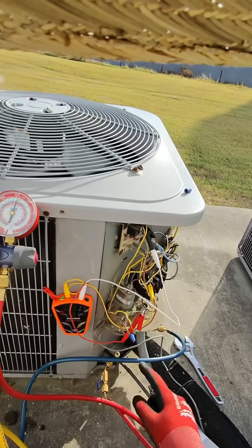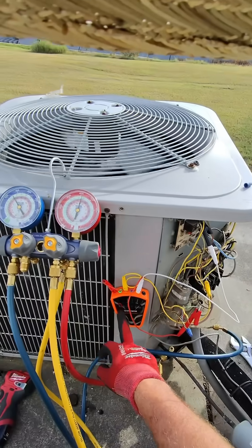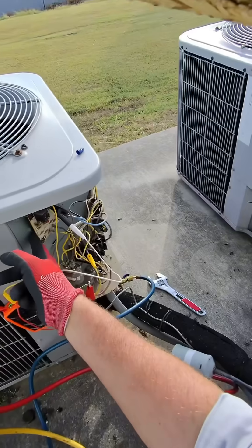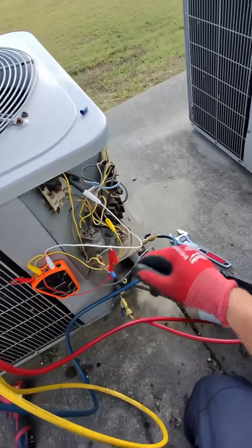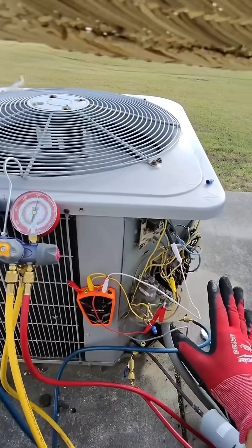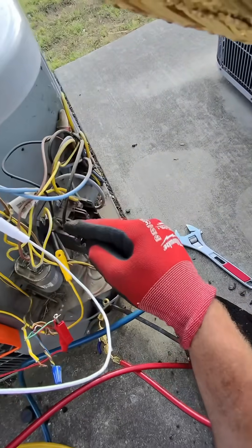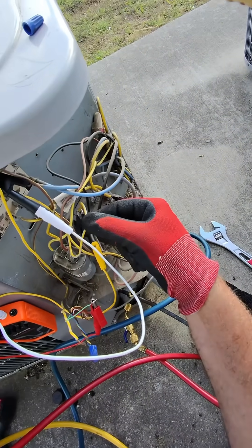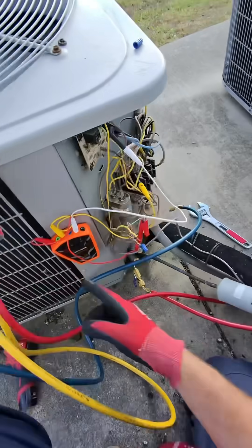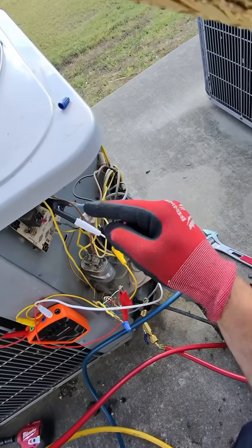This is our setup. We have our jumper king and we're getting our 24 volts from the thermostat inside. I have the board hooked up — this is my white wire, you can see that's going to 24 volts. The main thing I want to concentrate on is the yellow wire, which goes to our 24 volts on the contactor, which is this one.